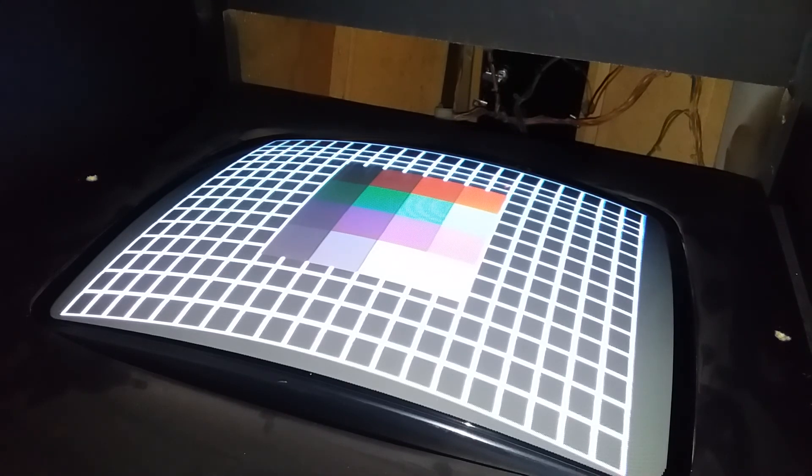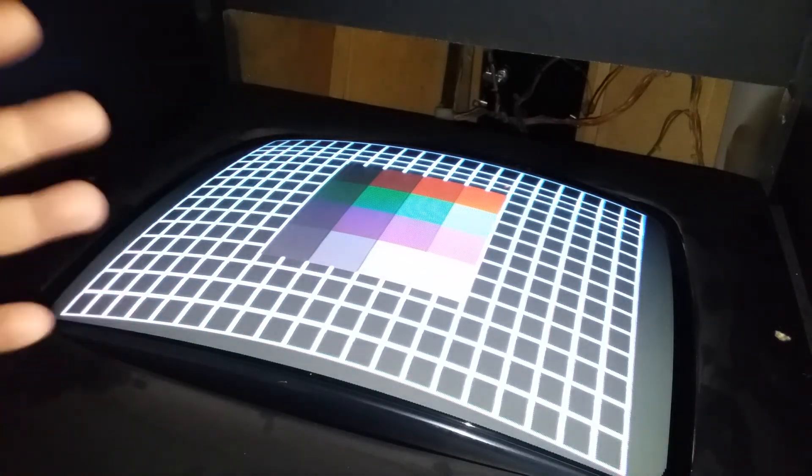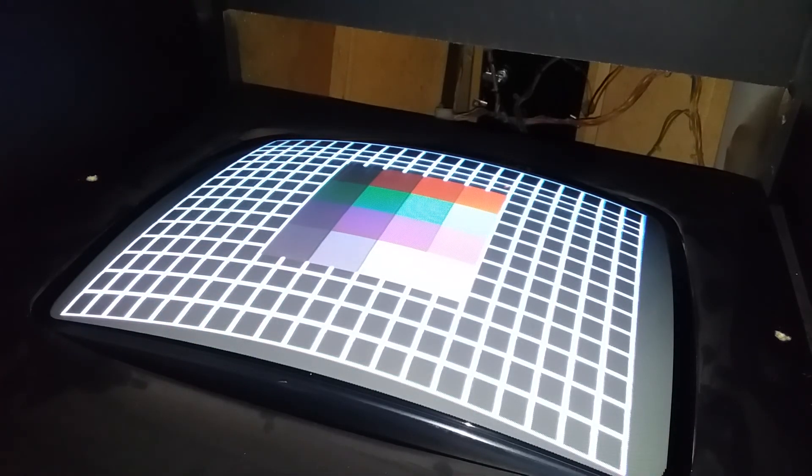He did the soldering while I was at work and I got this weird three images on the screen. When I came home I turned the pot up, the screen started rolling really fast and then evened out, getting rid of those three ghost images. So now I have this picture but I'm having a real hard time with the colors.